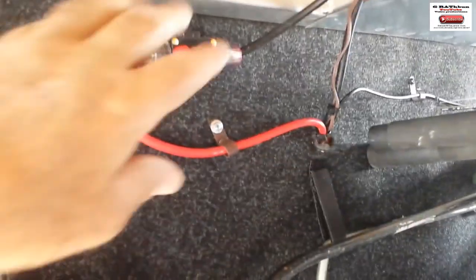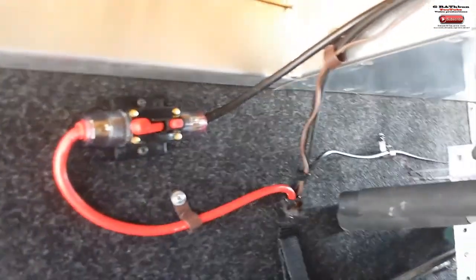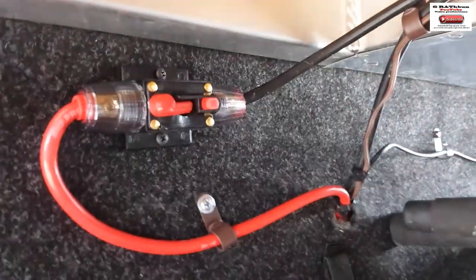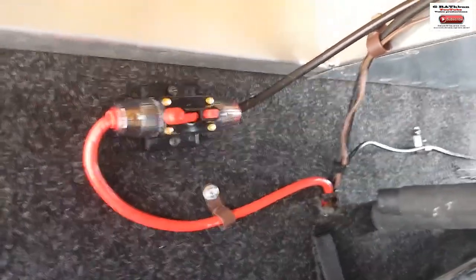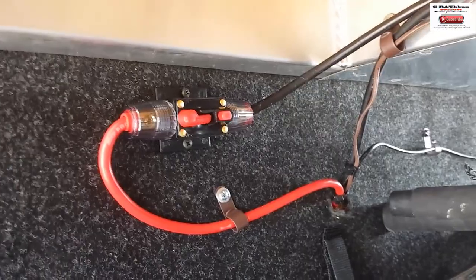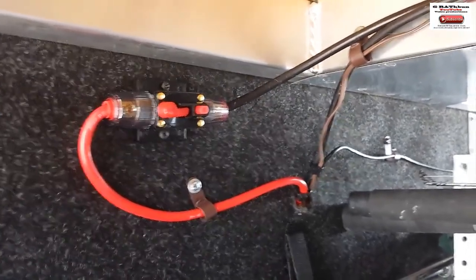What you're looking at here is a 30-amp fuse that comes from my solar panel. The black wire was too short so I ran a red wire from the other end — it feeds my control panel. The brown wire is attached to an LED light that goes into the coach itself, because when I'm dry camping there's no light in there and it gets dark in the woods. It pulls barely any power, but it's hooked up to my load on the controller, so when the controller stops charging due to lack of sunlight it will switch that little LED on — I'll know it's not putting out a charge, and I'll be able to see where I'm going.